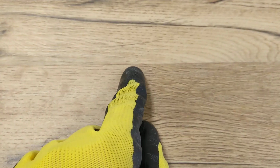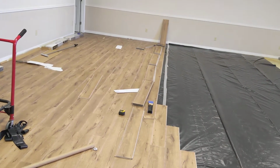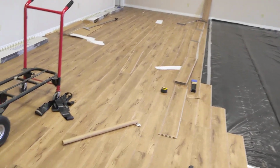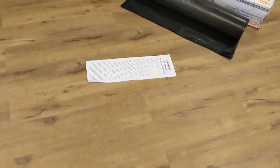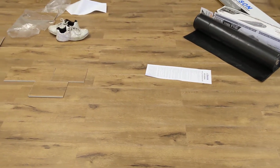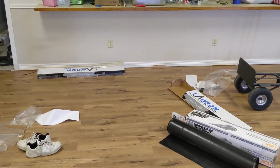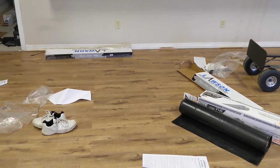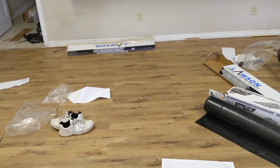So you can see right here, perfectly joined together, perfectly joined together, perfectly joined together. There is no open. That's because the whole floor is all perfectly in line. I know because I checked it a couple of times with the laser, making sure that it's totally straight. So that is probably the number one thing that you've got to do. You've got to use shims up against your wall. You've got to use either a string level or a laser to get your floor perfectly straight.